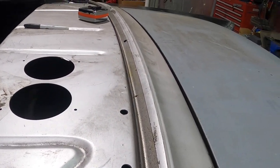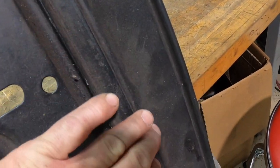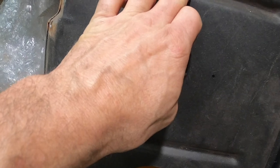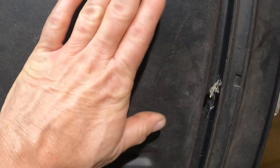What I did was I pulled the old package tray out of the bin, had it here in the garage for a couple weeks, been looking at it here and there. I've got it sitting here for a reference so I know basically where I want this channel piece to lay. The first thing I found out was these stiffening press marks, from this groove to this groove, is roughly 7 1/4. And the notch on our channel piece rests, eyeballing it, pretty much right in the center of those two pieces. So I'm going to go by that.